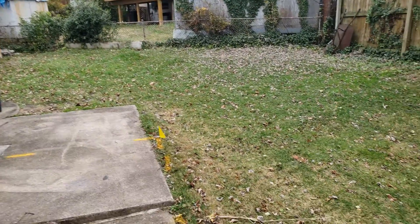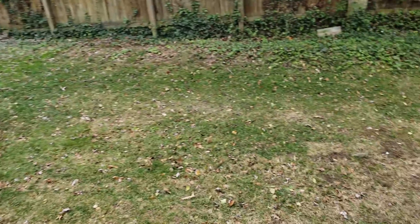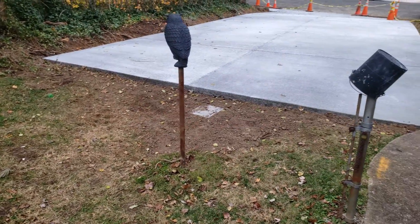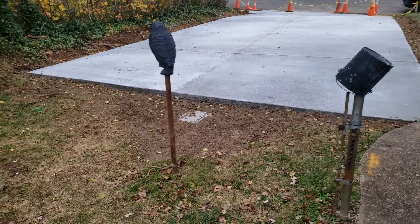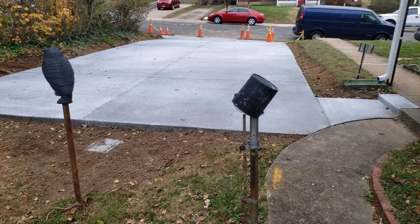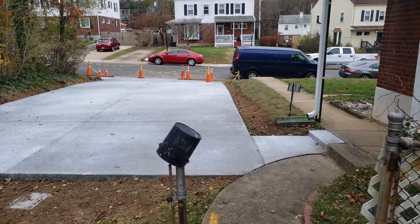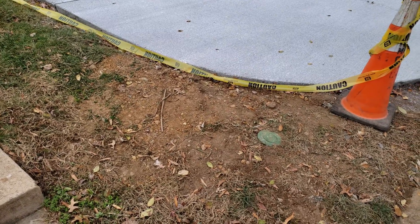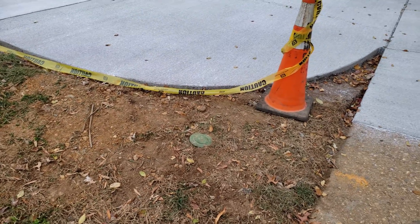In the rear of the property you can see that this hill kind of flows right through here — this would have been the natural swale where the water was running. We were a little concerned putting this driveway in that there was going to be water collecting, so at the last minute we added in that drain box, which daylights over by the street with enough fall for the water to run off properly. And there's the pop-up valve for that drain box and drain pipe.